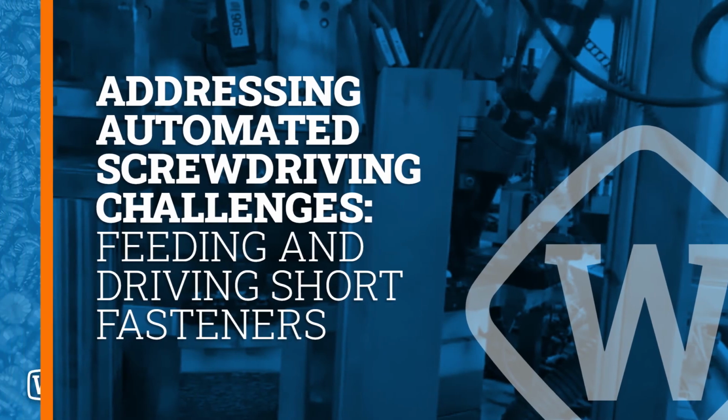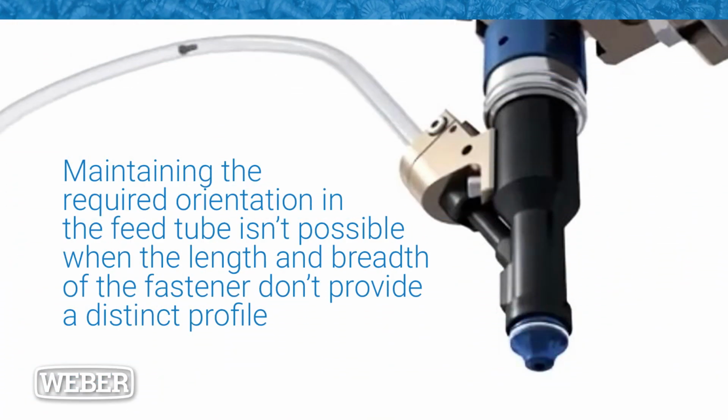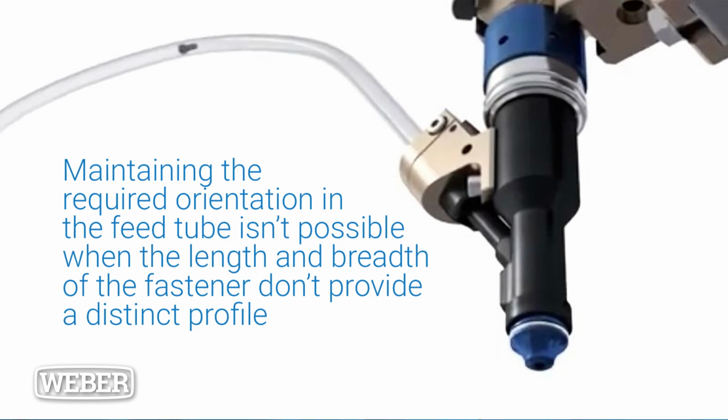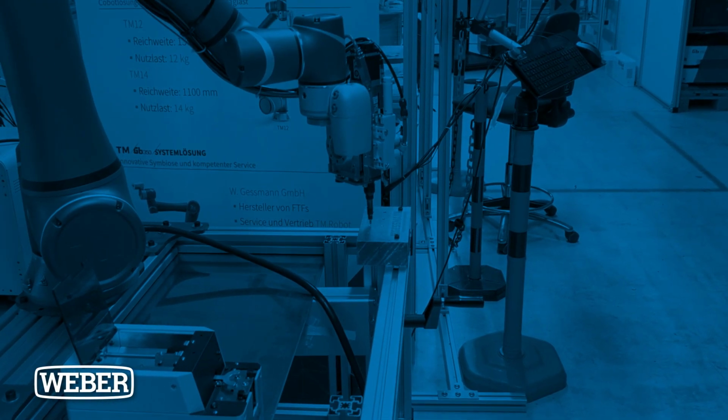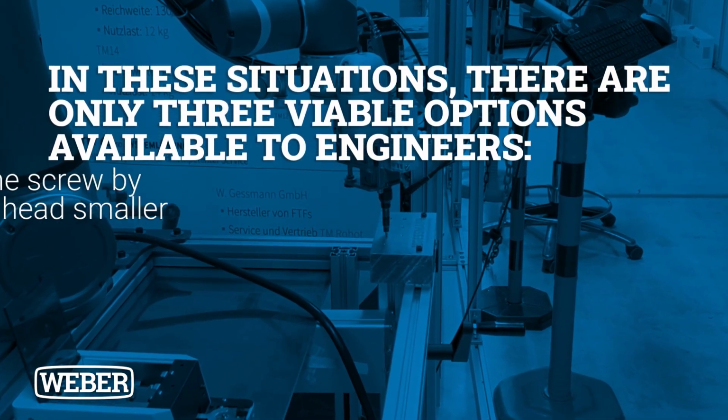Feeding screws that have a shorter thread profile than the dimensions of the head present a challenge to automated assembly operations. Maintaining the required orientation in the feed tube is impossible when the length or breadth of the fastener don't provide a distinct profile and may tumble in a round feeding hose. In these situations, there are only three viable options available to engineers.